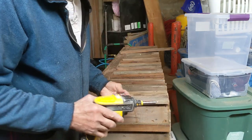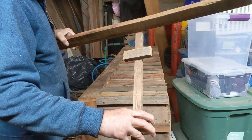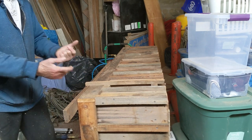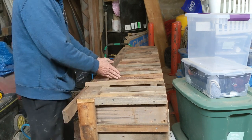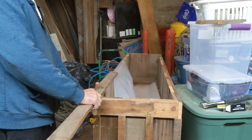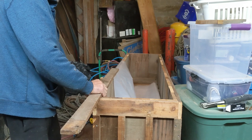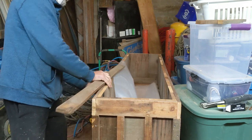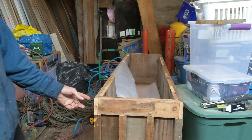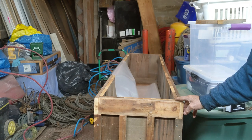In case if this one is not very solid in there I could use a screw. This jig here is the life saver - saves a lot of time, because once you put it, it just bang bang bang, fits in there. You can see you have support on this part, that way the board doesn't come up. You just don't have to think about the size - all the same size. Here I am with my box - this jig here was pretty much a life saver, saved me a lot of time. Just put it on, move it on, works very good, remove it, move to the next one. We had everything straightened up. On the corner I just put a few extra screws, that way it would hold better, because sometimes the finishing nails don't hold that good.